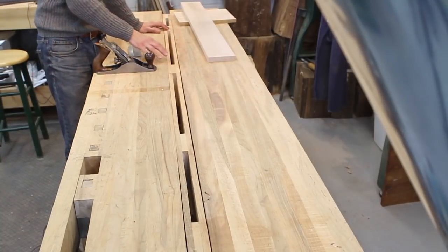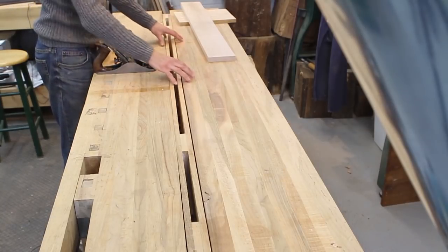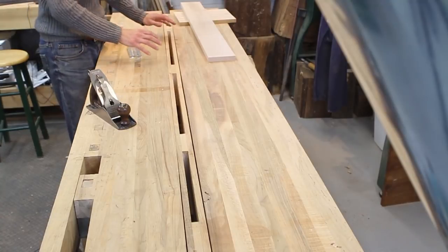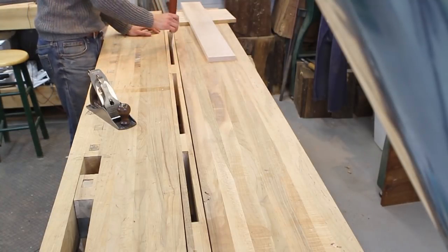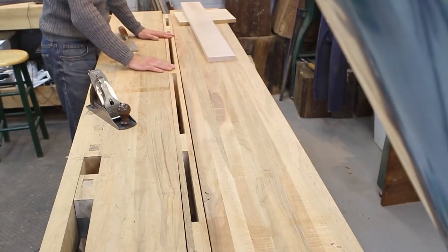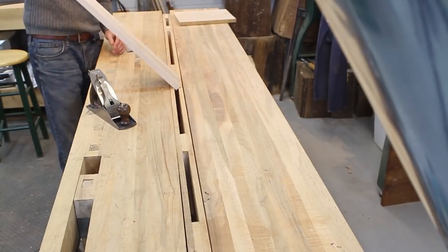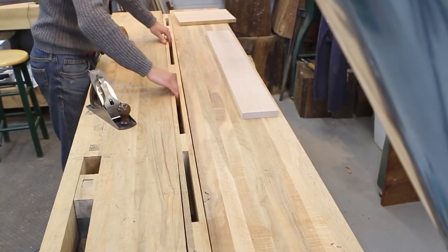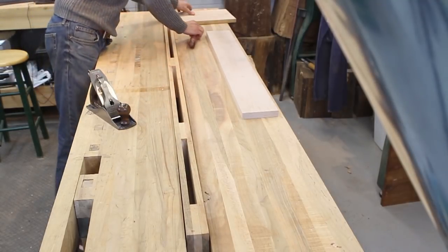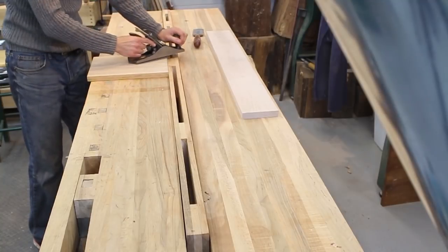The next thing is the gap between the two slabs. A lot of people ask why it's a good idea to have two slabs with a gap. The answer is flexibility — you have a lot more flexibility in the things you can do with your bench. In its current position it's great as a tool holder so you can set tools in there as you're working so they don't roll off the bench. The gap doesn't get in the way because it's recessed enough. The next position is if I lift it out and slide it over a little bit — now it's raised and that's handy as a little planing stop. You butt a board up against it and plane this way.